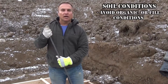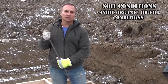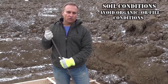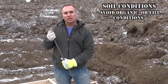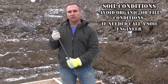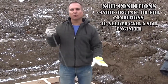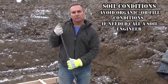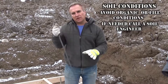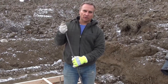If you're not sure, you could ask your excavator — someone with a lot of experience who has a good idea whether you're on native soil or not. If you're still unsure, you need to call a soil engineer. The soil engineer will come, look at the soil conditions, and probe the footing areas to make sure they're fine to go ahead and pour the footing. Your building inspector may know or may not know, but you can't really rely on that.